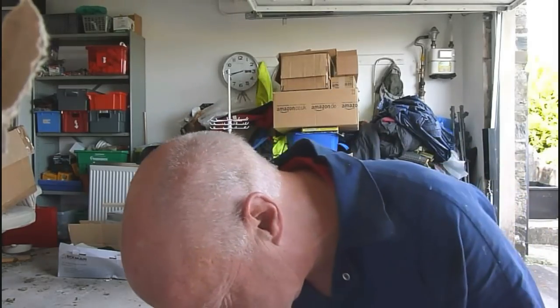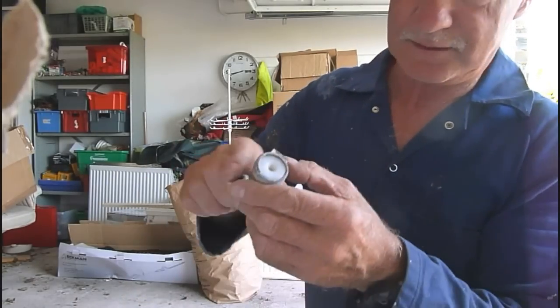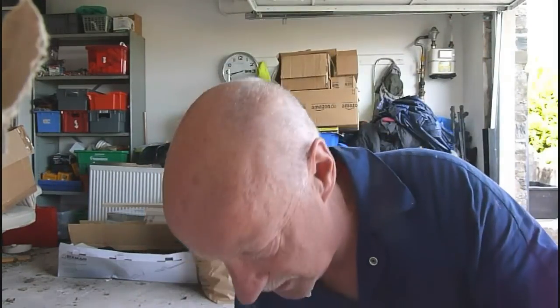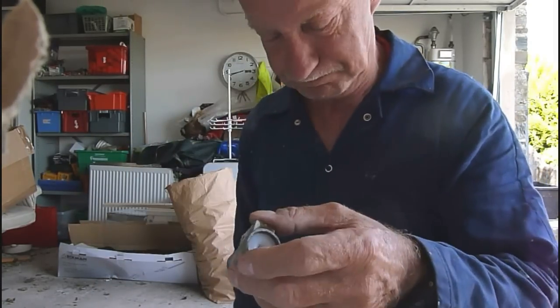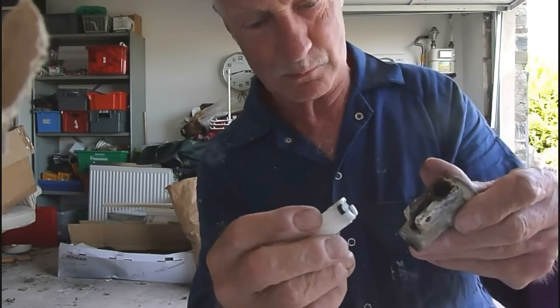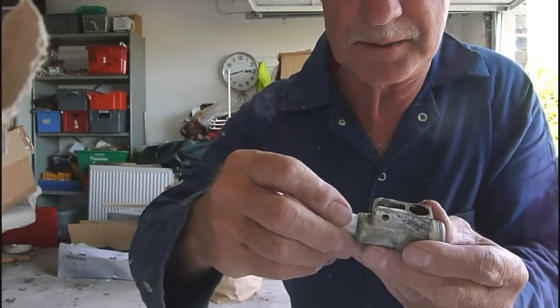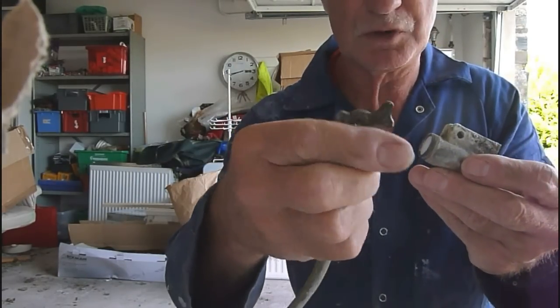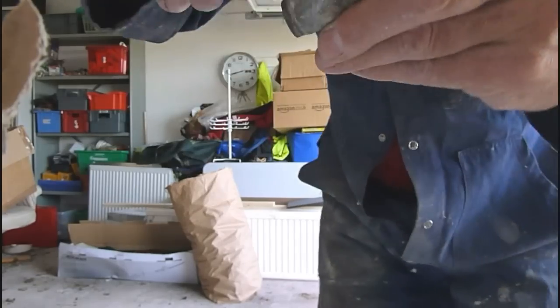Now it's ready to go back into the ball cock. Get your new seating — there's ours, we've got a new one here. You can see it going into the end of the valve. Don't forget: don't put the old washer back, get a new one — you should get that with a plumber's merchants. Then get your jumper. It goes up against the seat with the slot facing downwards, in line, so we slot it in and push it in down the line. Plumbers often oil and grease this to make it smoother, but it just slots back into the arm inside the piston.